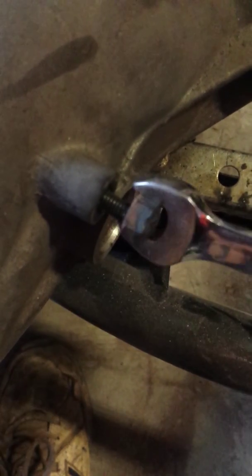And there you go. I'm not going to be stupid enough to reach down there and grab that. I'm not saying I'm smart or anything, but I pretty much know that is still hot. But that's how you walk out a broken off bolt with a little bit of wire welder, some tossed out nuts, and just a few seconds of your time.